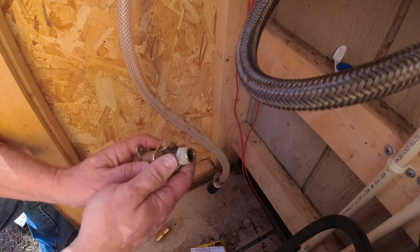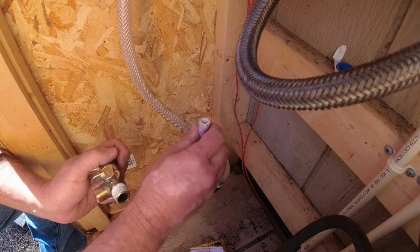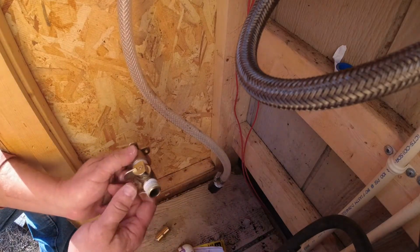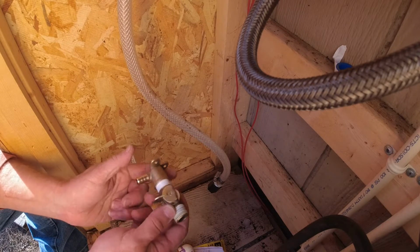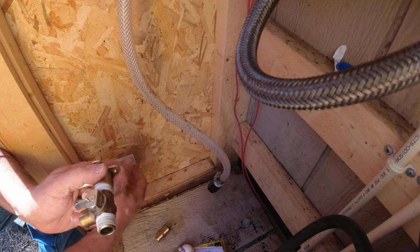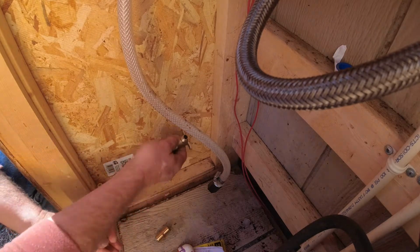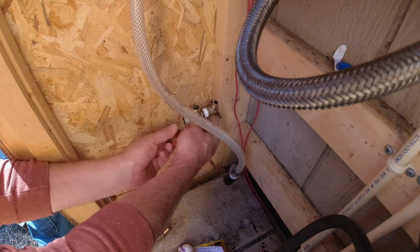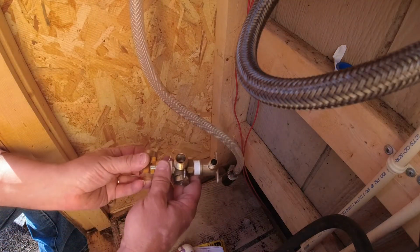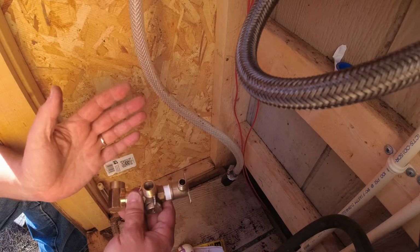the cabin. The problem was this pipe did run down over up under the cabin and out the side, and that's where the supply water came in. So I'm going to change that up in the box that I've built on the side of the cabin that has the water heater in it and the propane bottle. I'm going to do something like this. Mount this and elbow out through the side. And then it's just these few brass fittings that would be the water coming in that wouldn't be winterized or have antifreeze in them.